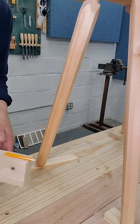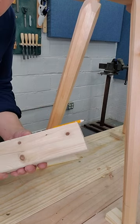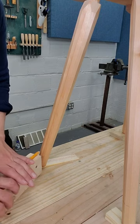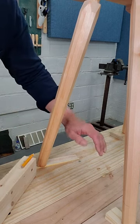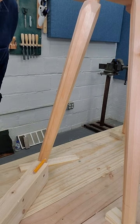Then I want to take an inch and three quarters off the length of each leg. So I made a block an inch and three quarters high and glued a pencil to it. I'm going to register that block against my bench top and scribe a line around the bottom of each leg. Because I'm keeping the block on my bench top, all my lines are going to be parallel to that surface.